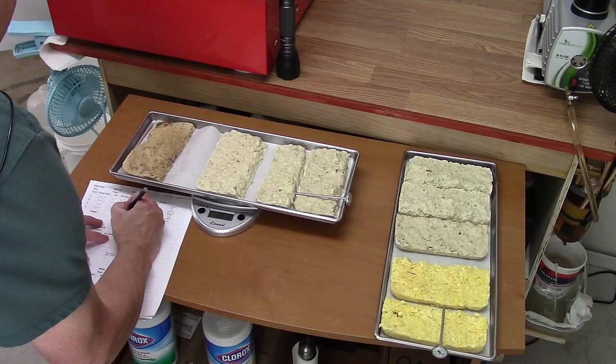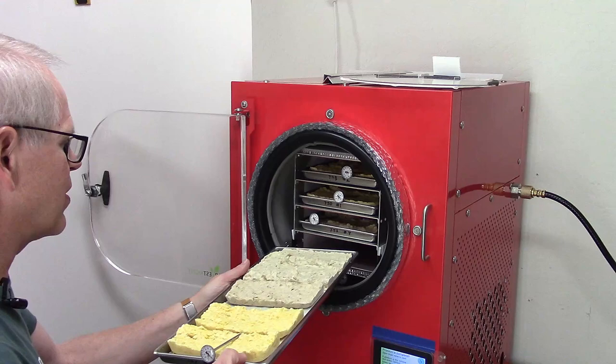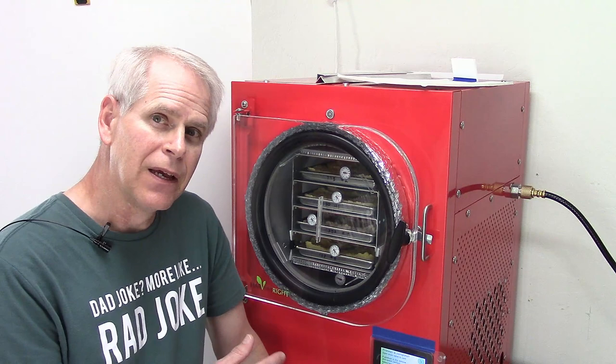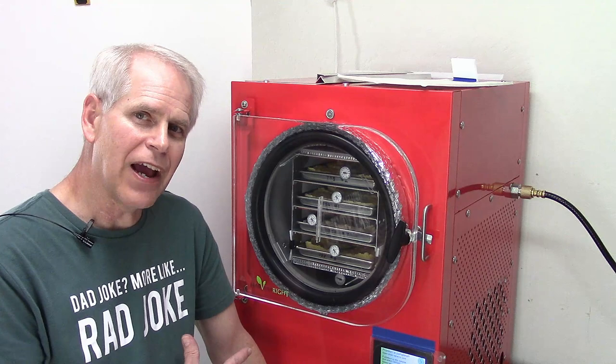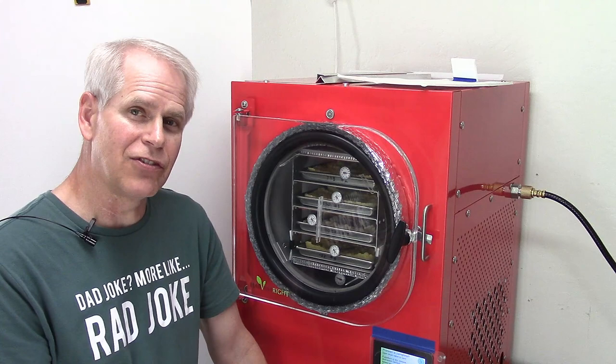1018. Now, these can all go back up, and tray 4 will come up one spot, and tray 3 will go down a spot. With those back in there, we'll restart the machine using the more dry time and get them re-drying, or continue drying for 2 more hours and then check it to make sure that it stopped losing weight. If it loses more weight, then we'll put them in for 2 more hours and we'll keep doing that with at least 2 hours at a time until it stops losing weight.